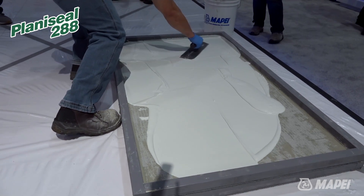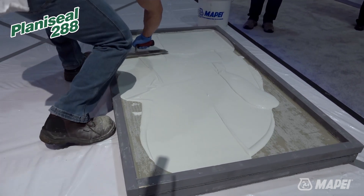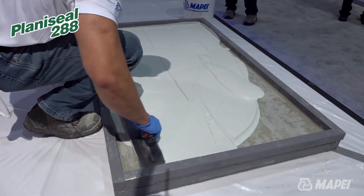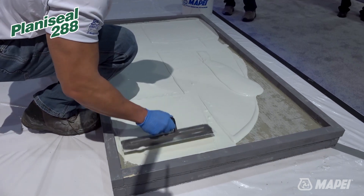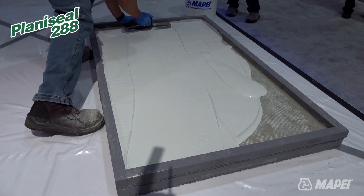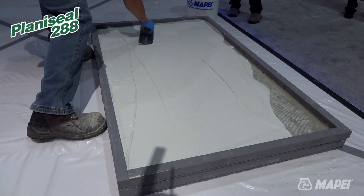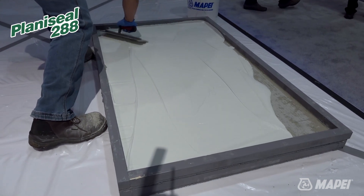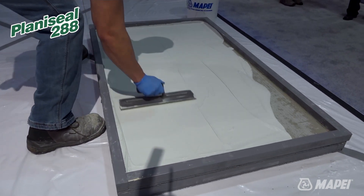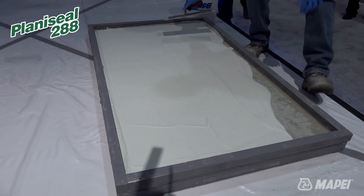The most important coat is the first coat when you're doing a waterproofing, especially with that mesh in there, because any cracks that develop in the concrete substrate — and all cement is going to crack — will not transfer through because the mesh will prevent that. If you have a crack in your waterproof system, you are not waterproof. If you have a crack in your above-ground swimming pool, it holds zero water. Use the mesh on the first coat and then trowel on the second coat on top.